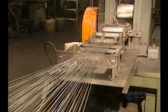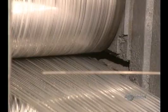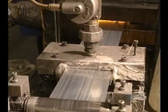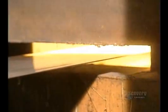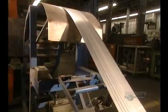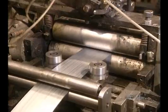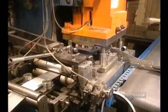Now, we move on to the fabrication of staples. The staple press finds 80 iron wires, which have been well lined up. The 80 small wires are placed side by side. The wires are glued together, then come out well-adhered to one another. The staple strips are fed into this machine.